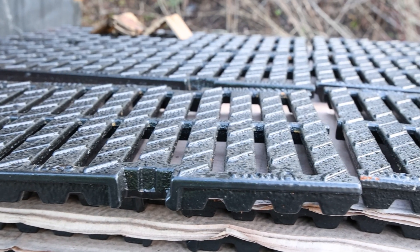Another common area where people install channel drains is on a driveway. If we're having a new tarmac driveway done, what kind of channel drain would you recommend? You'd want to step up to a heavier duty loading grating — 12 and a half tonnes, which is a B125 loading rating. With a tarmac drive you'd probably just want to go with a black iron grating.